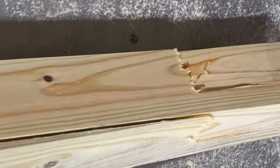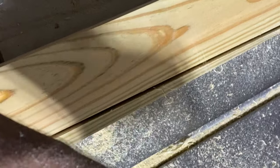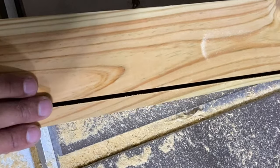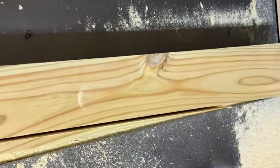Here are the remnants of my attempt at using the tapering jig. The issue is my jig is on three-quarter-inch plywood and this material is three and a half inches thick — the blade only goes so high, so it won't make the cut clear through the top. I did the cut in multiple passes as deep as I could get it on two faces, and then I decided to either hand-saw it or take my track saw to finish the cut.